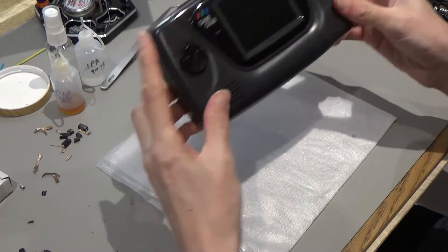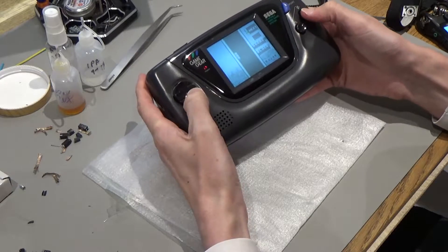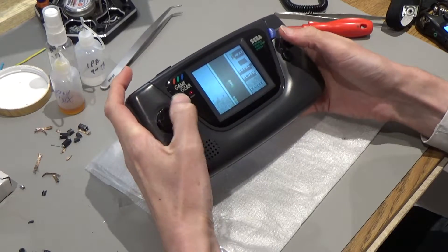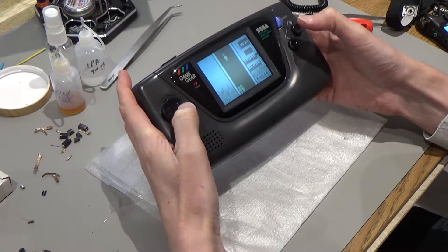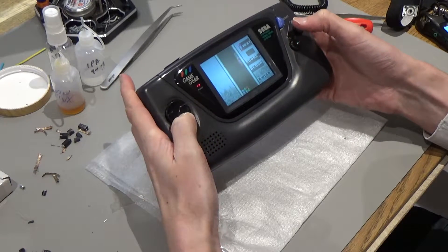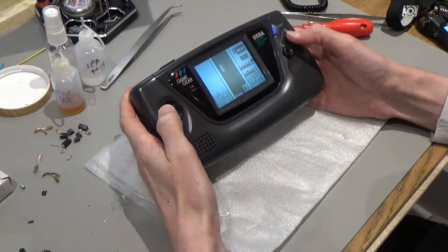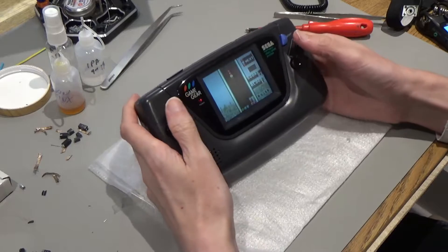This is the game from last time where I've repaired the main board, put new caps in the main board, and it's got no sound — sound does not work at all. So this time I'm gonna try and fix the soundboard. It has got bad caps on it, they have all leaked. So I'm gonna replace those before we do anything else. I'm gonna get the soundboard out and see if replacing the caps makes any difference to the sound.